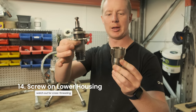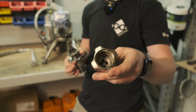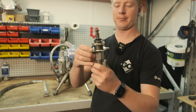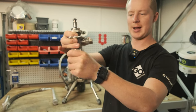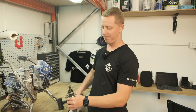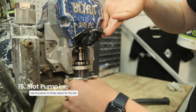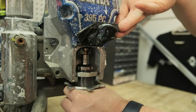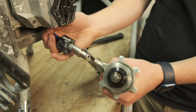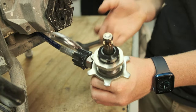Then you want to make the pump whole again. Put your lower housing onto your upper pump — make sure that all of your seat, ball and cage are in there correctly — and spin it on. It'll get to a spot where it gets hard, but it will keep going, and it should look like that. If it doesn't line up, a couple of quick taps should fix the problem. Make sure it lines up, then pull it back out, take the hose out, attach the locking nut, push it on, give it a couple of turns and then hand tight.